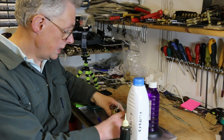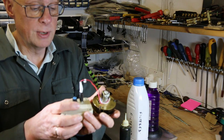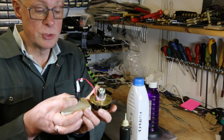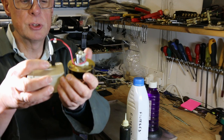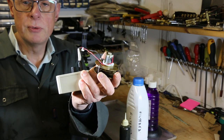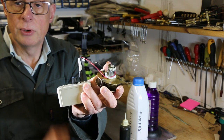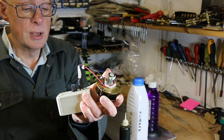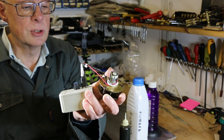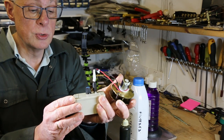You're also going to need an external blower. The difference between internally and externally fired engines is that internally fired engines require a draft in order to draw the fire. I've got a little fan here which we'll show a bit later. In this little box I've got four AA cells, a little voltage controller, and rechargeable nickel metal hydride cells which I recharge at the end of each session. So I've got decent power and know I'll have enough energy to raise steam.